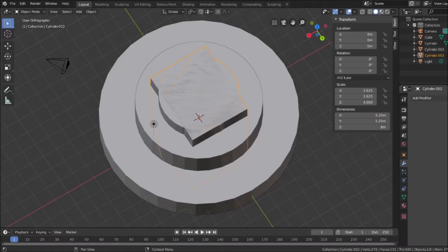Okay, a small cut there. I haven't really used anything other than difference modifier in Boolean operations for this, so I got a little confused. Here's what I'm going to do. It's a little hokey, but it'll still get the job done. The end justifies the means, as they say. I'm going to redo. I really thought that intersection would have just combined the two volumes only where they both touch each other, and it didn't behave that way.